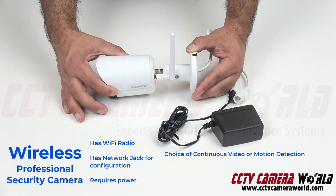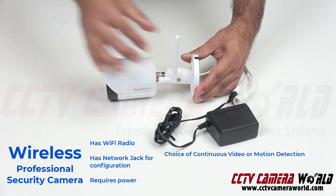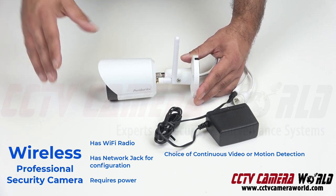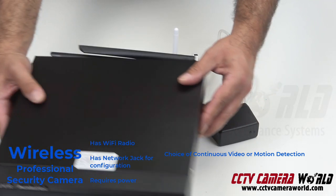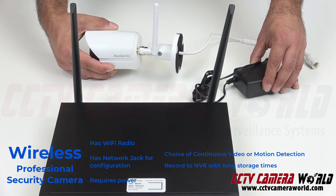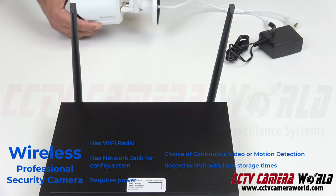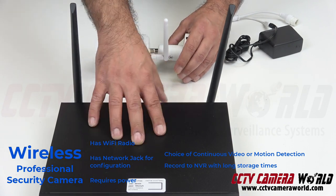This wireless camera is always running because you have continuous power to it, and it's constantly transmitting a Wi-Fi signal back to the recorder. You can choose to pair it up with an access point or with an NVR. We have a wireless NVR here that has antennas on the back. You put a hard drive inside of this thing and place the camera up to 200 feet away without obstructions, or 100 feet with obstructions, depending on what's in the middle. The camera sends its wireless signal from its antenna to the antenna on the NVR, which saves the video inside the box.